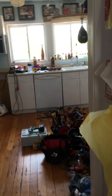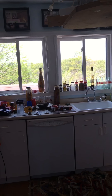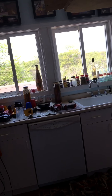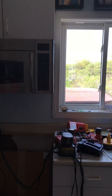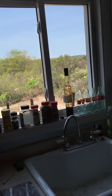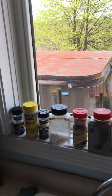I'm going to do a brief video of what's going to happen. This will be the family room floor. The kitchen is going to be torn apart — everything's coming out eventually. Right now, where these two windows are, I have to open up the wall and the ceiling because I have to add jack and king studs on either side of this window opening, because eventually this is going to be a sliding door to get access out onto this deck, which is going to remain.